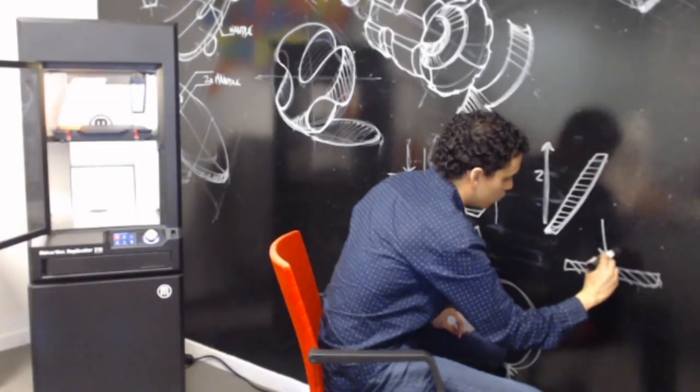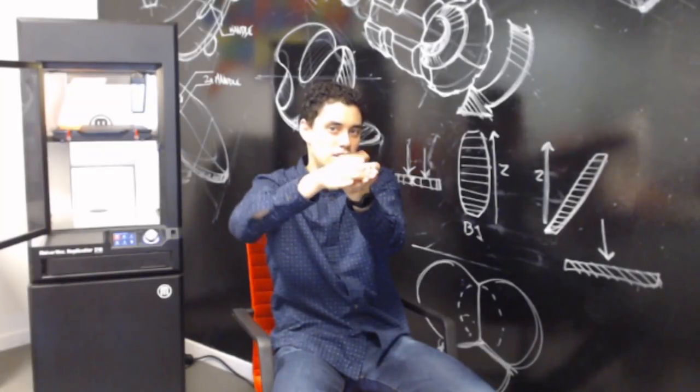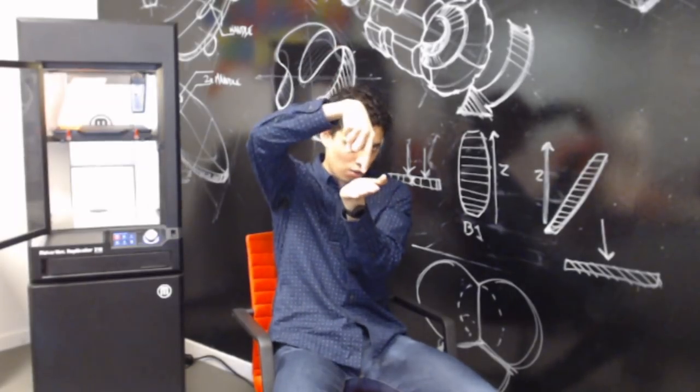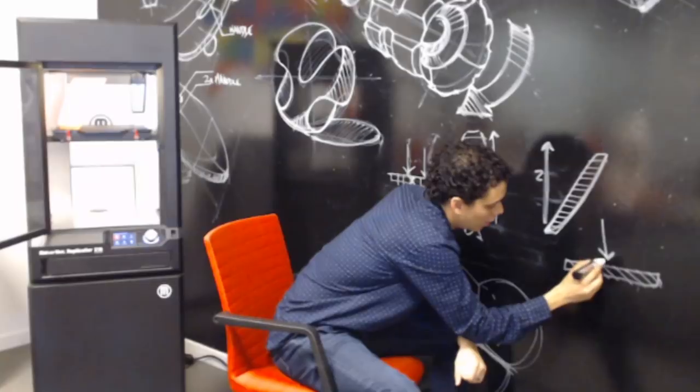What this means is that as soon as I apply the force on that board, that slantedness is going to help the plastic keep grip on itself. Think about trying to break a set of wooden planks that are lined up like that: any one of the seams is going to give way when you apply a force. If you slant it a little bit, then you're no longer just trying to peel off one of the seams, but rather trying to slide them sideways. And that's much harder, because there's already the resistance of each of the seams trying to attach to each other. By not having the load be perpendicular to the seam, we're taking into consideration not the perpendicular load, but rather the component of the load that's going to be applied on each of the seams.